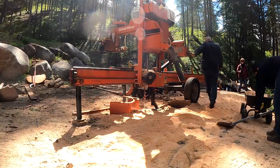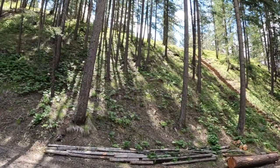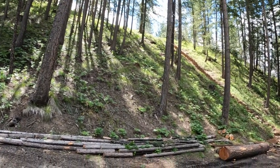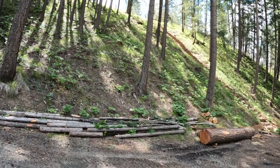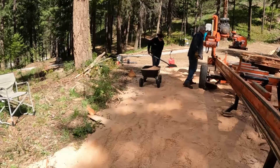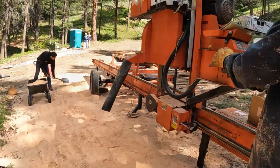You know, those things you use to pound the sand down when you're putting some bricks on a sidewalk. The mill outriggers are just steel feet. When you have that maybe six-inch square chunk of steel sitting on the ground and you load these big logs on them and they bounce around, it's just like pile-driving those outriggers into the ground. So you've got to reset them from time to time, just shim them up a little bit, make sure they've got good contact with the ground and good pressure so that you'll keep that main beam on the mill nice and solid.